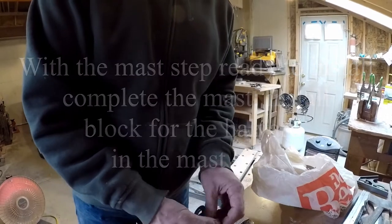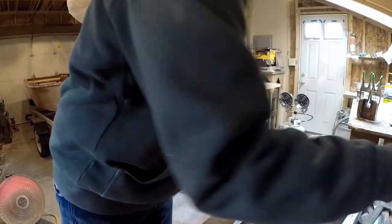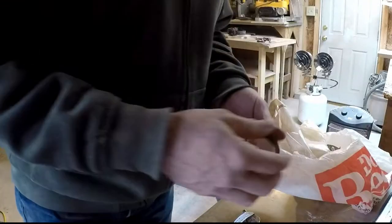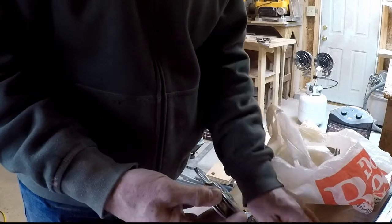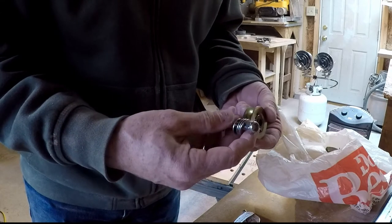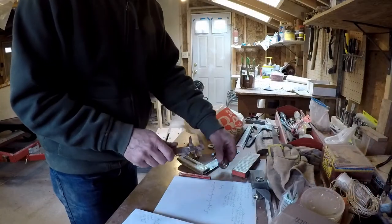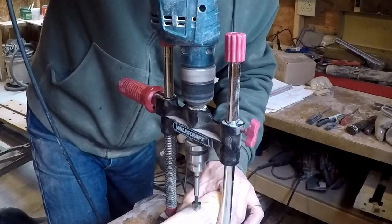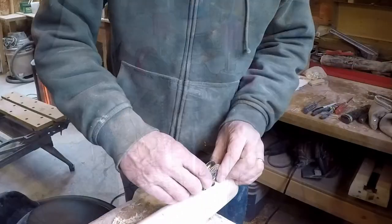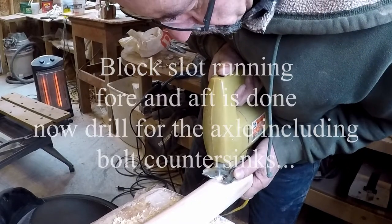Masthead hardware is this replacement axle — that's what I've done before and it seems to work okay. A little bit wasteful; I've thrown away this bracket. It's got a nice nylon bearing. I'll replace that with stainless steel and a lock nut through the masthead. It's got another clutch on the joint and a nice roller.